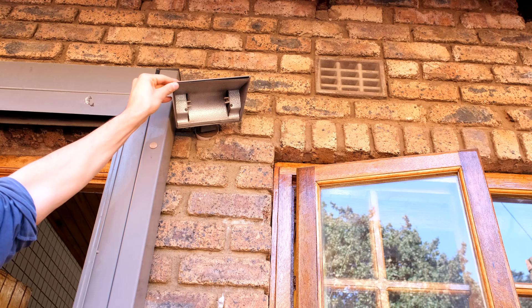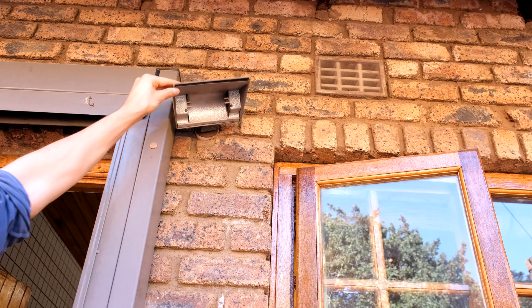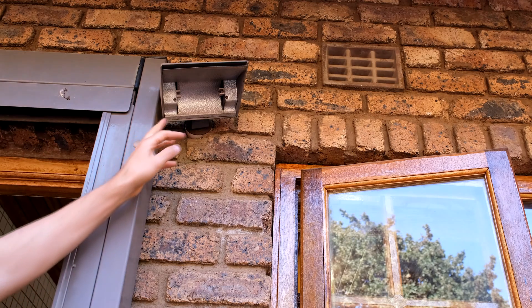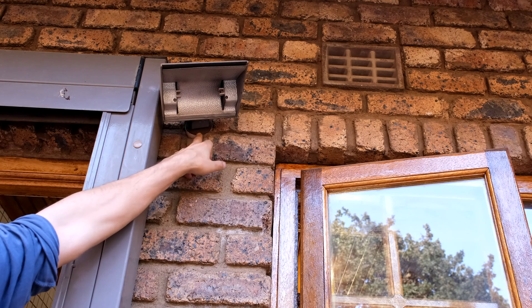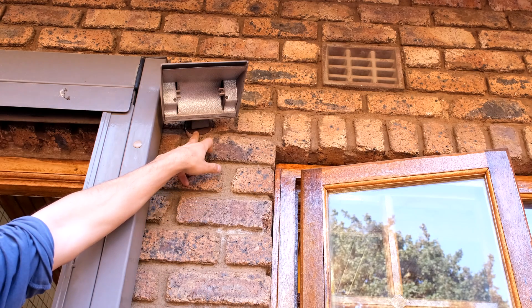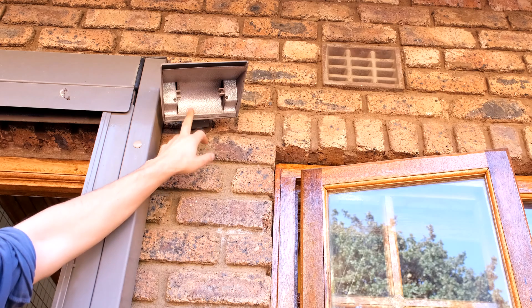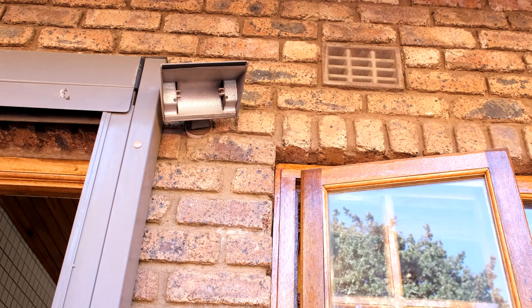I'm lucky because here is an outside light — this was the dead circuit. I had two light switches. This is a very old fitting that normally had a halogen globe which is very power hungry, so we don't use these so much anymore. I'm going to disconnect this and find the neutral here, then feed that neutral back down the conduit into my light fitting. The other circuit is here from that dead circuit — the live that was coming from the light switch. I'm going to remove this, catch the neutral, thread it through, bring it down to the wall switch, and then I'll be able to install the motion detector.